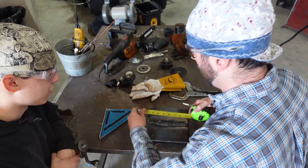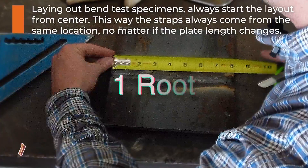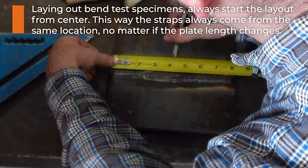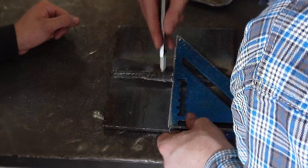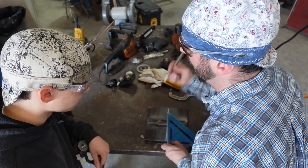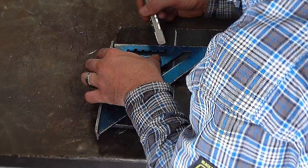So this is a real typical way of laying out a test plate. There's only two coupons because we're going to do one cap and one root bend. We measure the plate — it's eight inches long, which is real typical for a lot of test plates. We mark the center first, take our square, and then lay this out. The code tells you a certain way it's got to be — the bend straps have to come from a specific location, you can't just pick where you want to pull them. We measure center first and we're at four inches, then we measure an inch over.